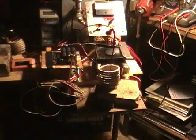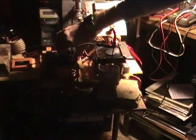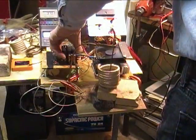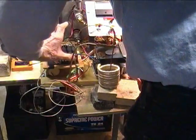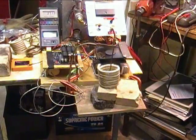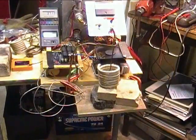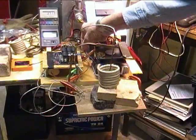Something's smoking — I've got to turn things off. That wire connection to my second set of capacitors was starting to cook. Capacitors are a little warm, but the post is really, really hot, so it's a bad connection there. That one's not a good connection either. I was using about 14-gauge wire to hook up here.